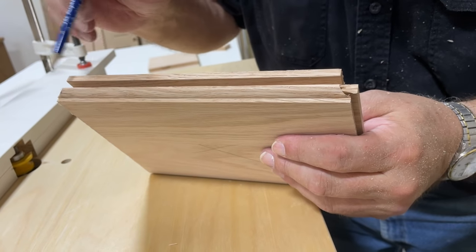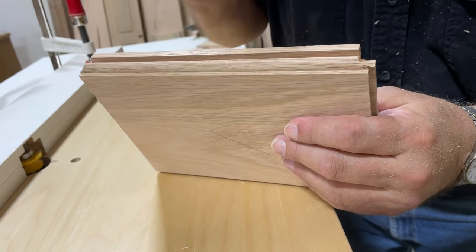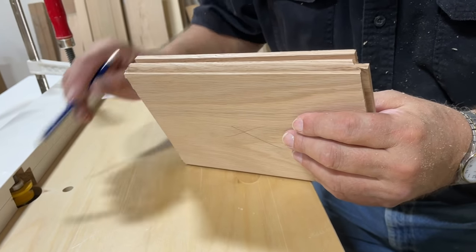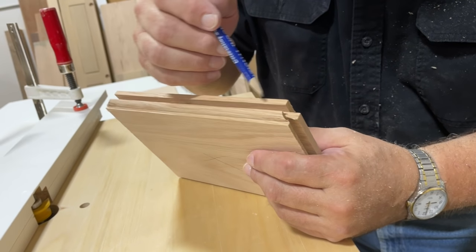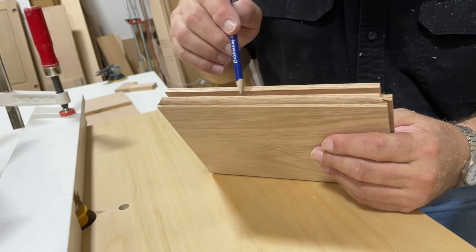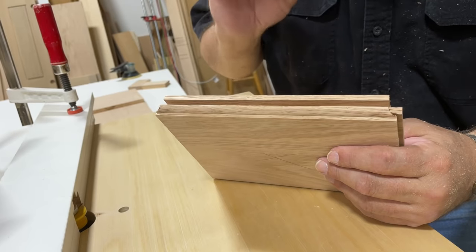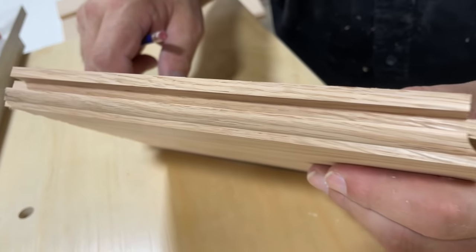That is just going to make our door so much nicer when it goes together. It's just a little trick to make your edge turn out nicer. Your router bit doesn't take off very much when you redo it the second time. You're just taking a 32nd off, and it just cleans up that edge so nice, and it just makes a more professional-looking door. Let's finish that up. Get ready to put our panels together.